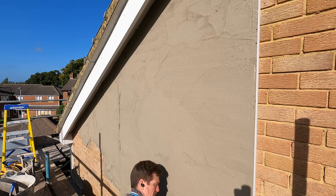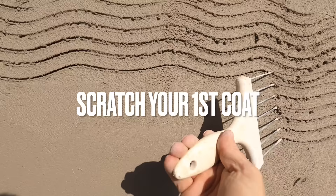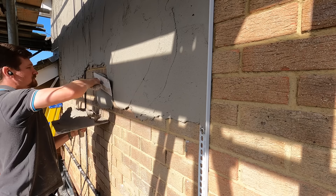I've had it so many times where sand cement's cracked or generally had problems. So what you do is you apply both coats in one day — we'll talk about that in a minute — but you apply the first layer and you scratch it up. This isn't too far from sand cement, but the magic happens later on, and this is what's going to change the whole process of rendering.